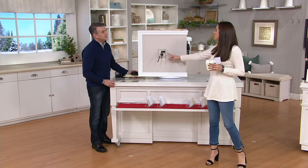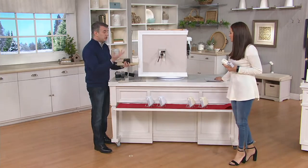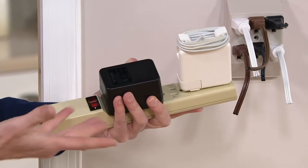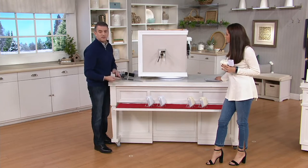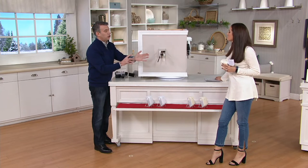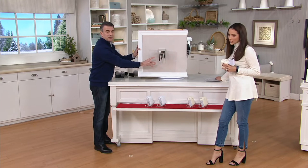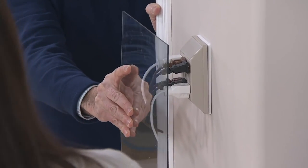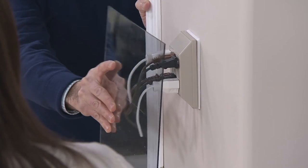Here I'm showing you an old-style unit — it's not grounded and doesn't have surge protection. This is the old style: we have two big plugs in it and you can't use all six outlets. The problem with this old design is if you're putting it behind a couch, armoire, or desk, the wires bend. They can fray, and a bent plug can become a broken plug — which is unsafe.